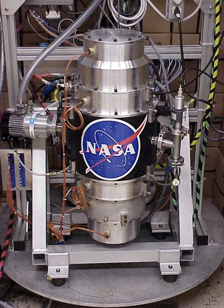Flywheel energy storage systems using mechanical bearings can lose 20% to 50% of their energy in two hours. Much of the friction responsible for this energy loss results from the flywheel changing orientation due to the rotation of the Earth, an effect similar to that shown by a Foucault pendulum. This can be avoided by aligning the flywheel's axis of rotation parallel to that of the Earth's axis of rotation. Conversely, flywheels with magnetic bearings and high vacuum can maintain 97% mechanical efficiency and 85% round-trip efficiency.